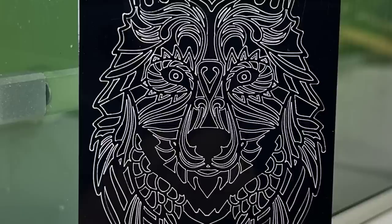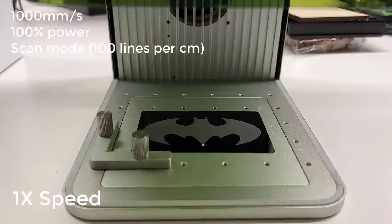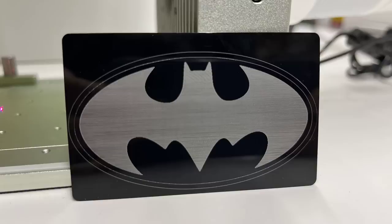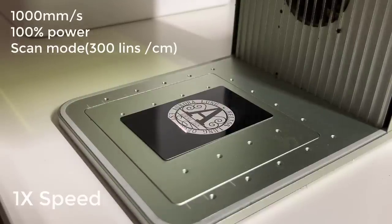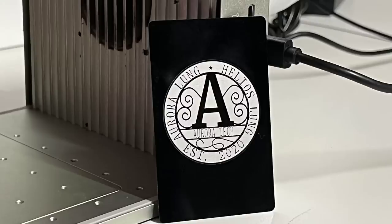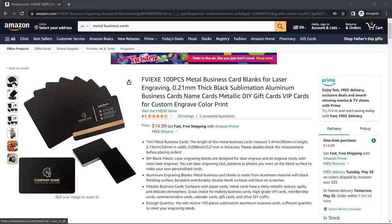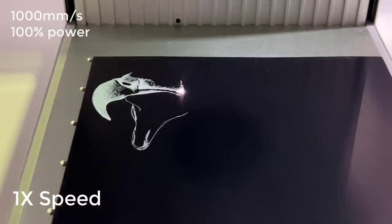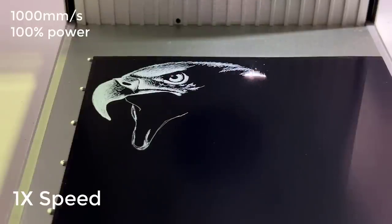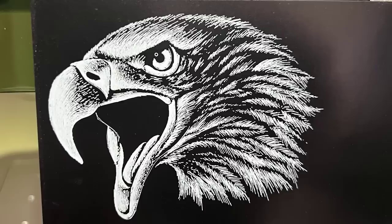The result is also very impressive. The details are really nice, and it's fun to be able to engrave something at this high speed. Next, I tried to engrave another Batman logo at the same speed. Since I'm using scan mode, it will engrave line by line. The job time is around 30 seconds. Then I tried engraving my own logo with the same 1000 mm per second speed, and it took 54 seconds to finish. The details are really awesome, and these metal cards are likely going to become one of my favorite materials on this machine. They are quite cheap, as you can get 100 of them for around $15. Anything with a layer of coating, not just these metal cards, should be able to be engraved at such a high speed. I would try another similar material, a black coated card. It can also be engraved at the same 1000 mm per second speed using the IR laser. Engraving this eagle just took 25 seconds.